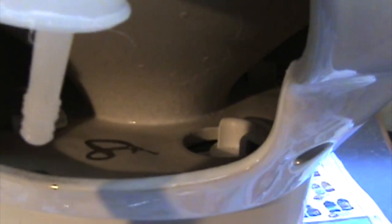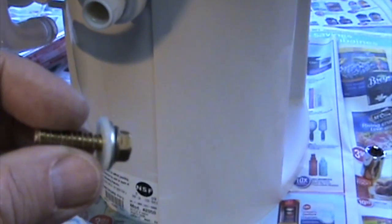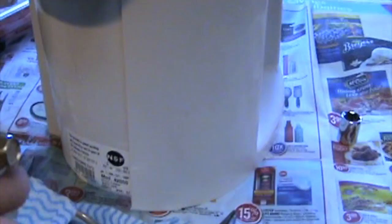I've also taken out the screws, this hole here, and then the other hole, and you can hardly see it. And you see those little plastic tabs back there, the white one. And then there's another one over here that's further in, and there's also two more right around the other side. We just have to rotate this clockwise to undo it, and it does undo, so it'll separate the top from the bottom. Also, the screws came out with a metal washer and a little nylon washer in this sequence right here. Don't want to lose them, we'll have to reuse them again.